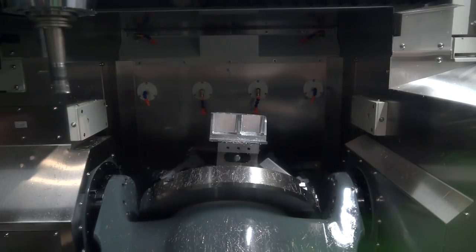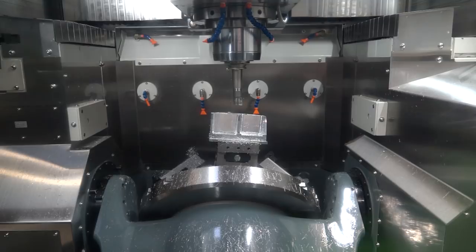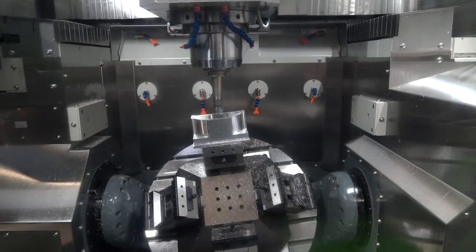So you could do turning as well on that table? At 90 rpm it depends — we would have to add a feature into the control to give us that turning capability, but really for five axis machining, getting from one side of a job to another it's a fantastic benefit. And that's key because some of the five axis simultaneous machining you look at is point to point, it has to be very nimble and very fast.